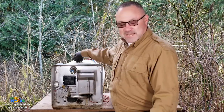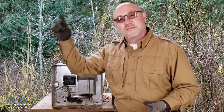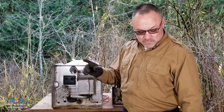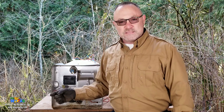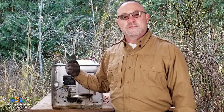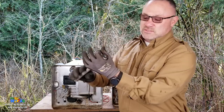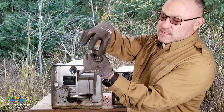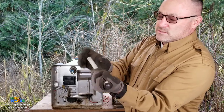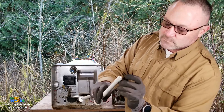And so that's what's kind of going on inside of these tanks, is you've got this metal tank with the porcelain coating on the inside. Now the important thing about the tanks is because they're metal and they rust, what we're going to do to prevent the rust is use an anode rod, okay? So this is an anode rod. The part you see on the body of the tank is just this part right here. This little welding nipple is the other end. You'll see it coming out here. You'll see that little piece.